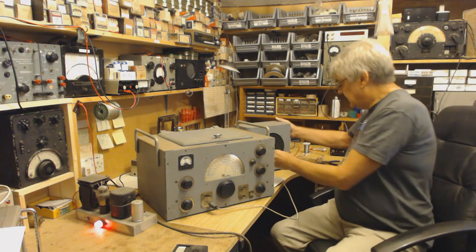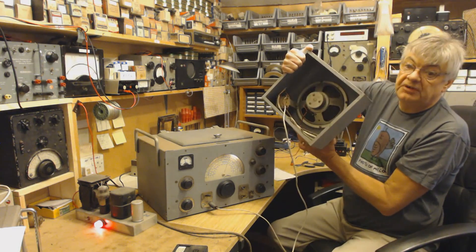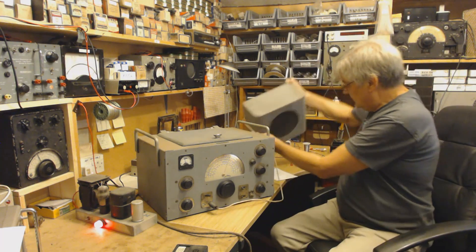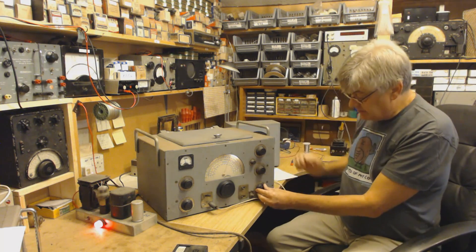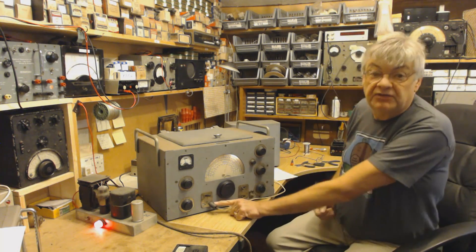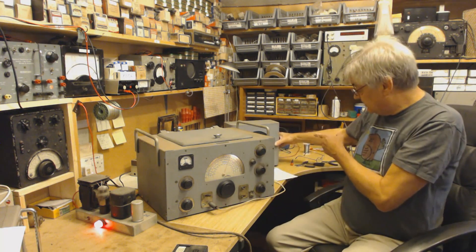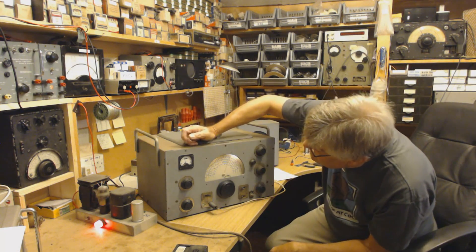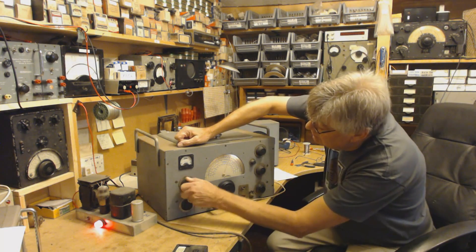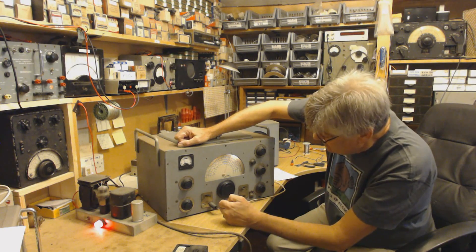The speaker, here we are. There's a transformer in there. That's a heavy thing - this weighs a tonne. The speaker's 600 ohms, the output for the speaker. That's why the transformer's in there, to match it to the 3 ohm speaker. There's a meter which seems to read the anode current on all the valves, which is good.